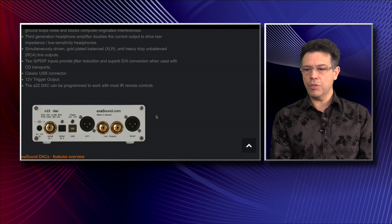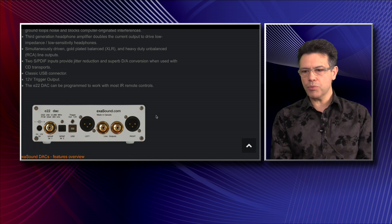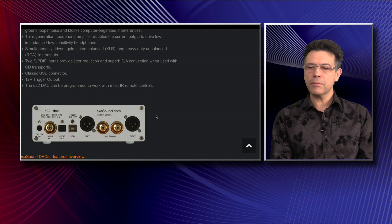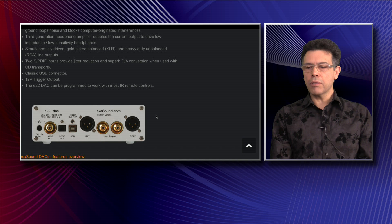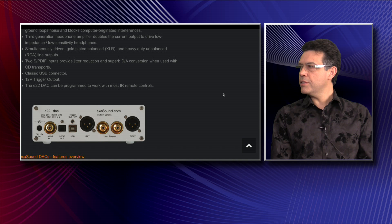The best way to use this device is to plug it directly into a power amplifier — technically you don't need a preamplifier because there's a built-in volume control. There's also built-in capability for remote control; it comes with a very nice Apple remote. The volume control works between the digital and analog domains — the DAC chip does its own volume control. It carries the best characteristics of both types: very high signal-to-noise ratio typical of analog volume controls, and no digital loss of resolution. The device comes with a 30-day money-back warranty, and it has a volume control bypass so it can be used as a straight output as well.